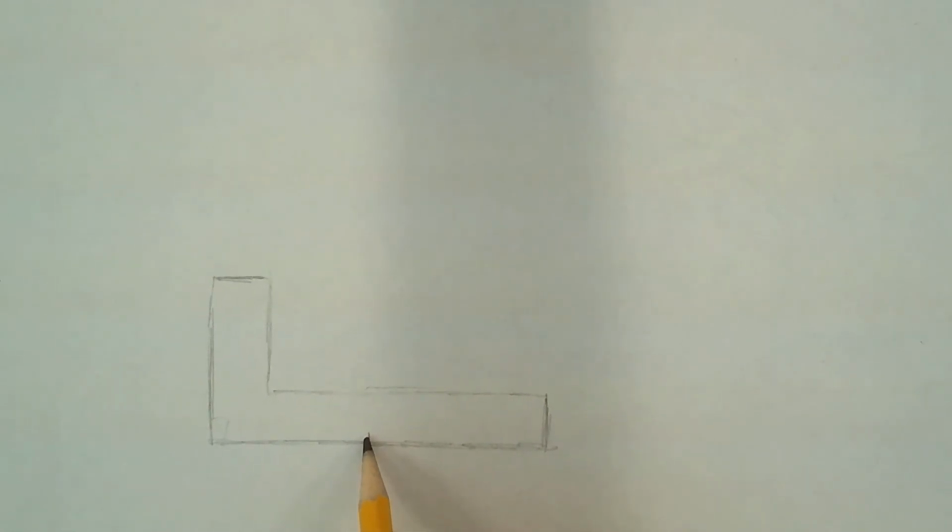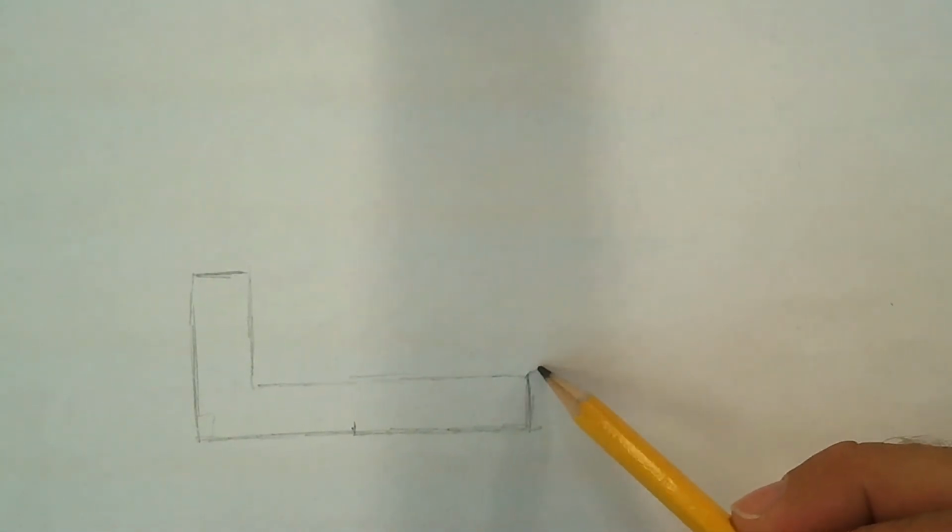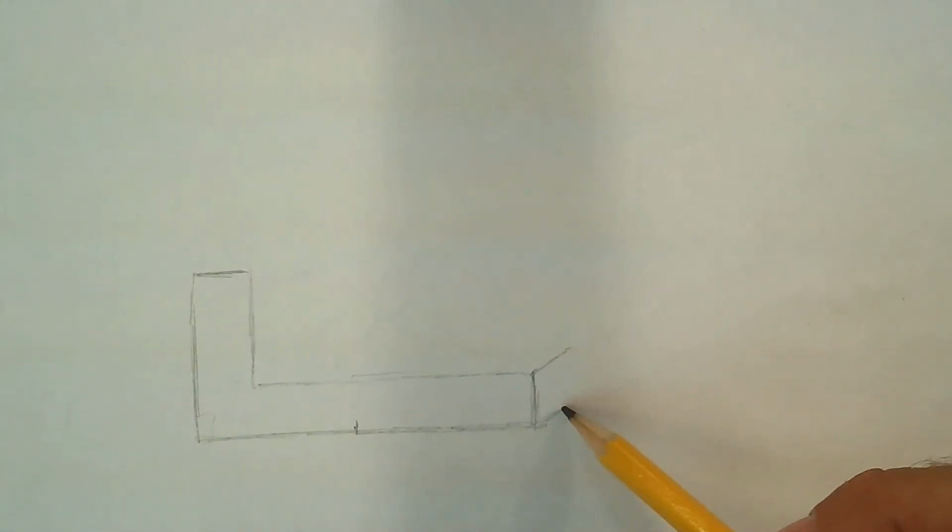So the only difference when we're drawing an oblique drawing is that once we look at it from the front, straight on, our depth lines can go back at the same angle that these went. But our width lines have to be what? Are the width lines at an angle? Well, trick question, because a 90 or a 0 is still an angle, but they have to be parallel to these horizontal lines. So we just have to start going like this. 30 degrees, 30 degrees, 30 degrees.